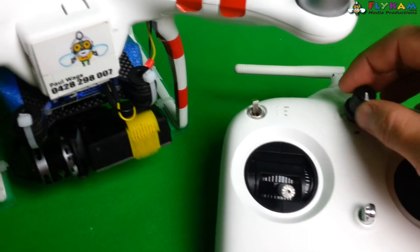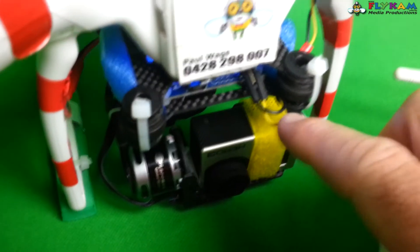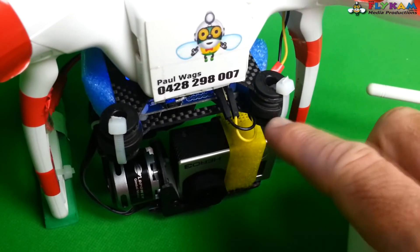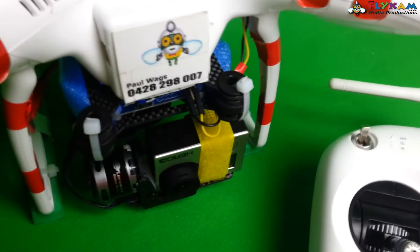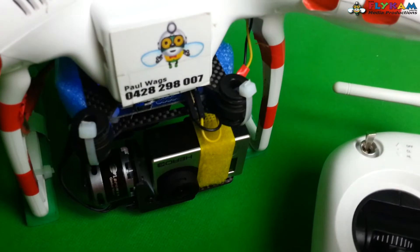So when you're flying now you can get some really cool shots. How did I hook it up to the NAZA on this gimbal? I have two wires — the black which is common and the yellow one — both run up into the NAZA F2. This is the pitch control, and in the NAZA software I set the pitch at 0.00, because you don't want any information being sent down by the NAZA.